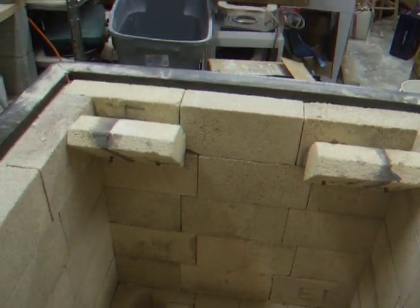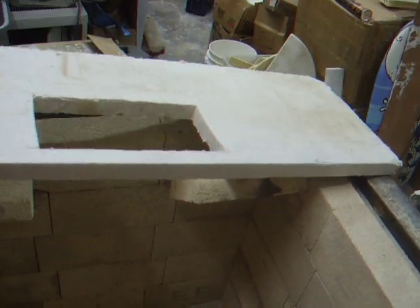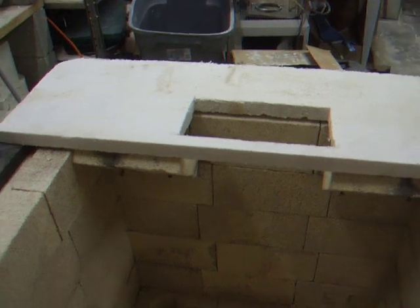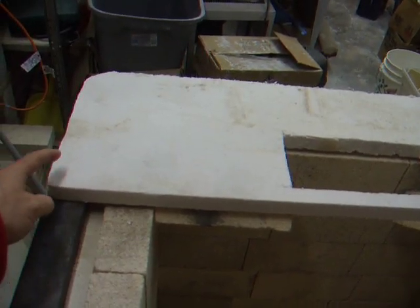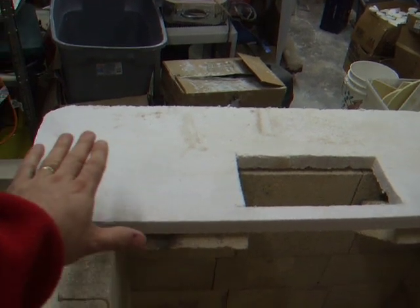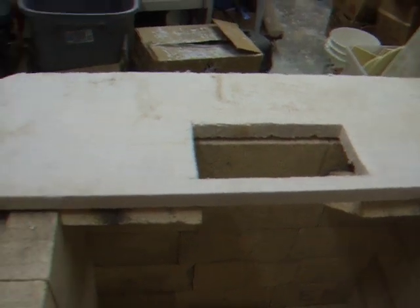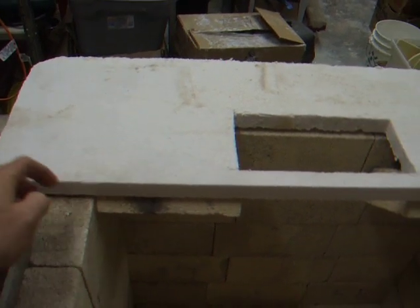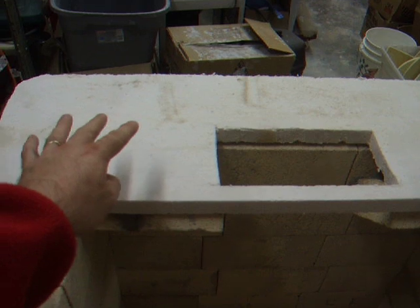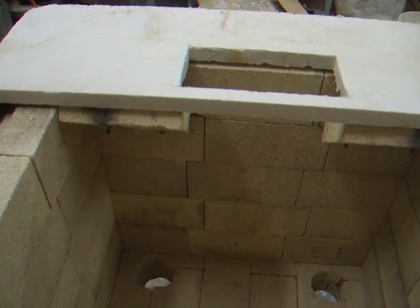This will be my chimney box section — kind of a plate that holds it all together. What I'm going to do is use the same material, put four inches around the sides, put this on the top with another identical piece, and fill the whole middle with ceramic fiberboard. Then right before I bolt this piece to the rail, I'll thread kanthal wire through this brick all the way through, and that kanthal wire will sit on the top or maybe inside and help tie everything together for support.